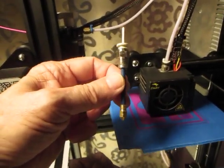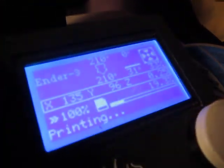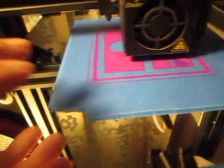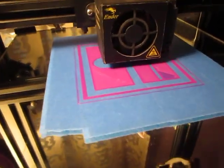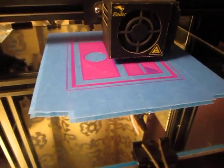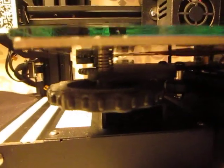Proof is in the doing. The bed temperature set point is zero — it's room temperature, 31°C — this is not a heated bed. It's not required when you print in this fashion. When you properly tram the bed, have the perfect distance, the perfect temperature, everything is good — it's going to stay put. You can see already: no curling, no brim, no warp, no messy purple Elmer's glue. You can still use all that if it works for you — this works for me.